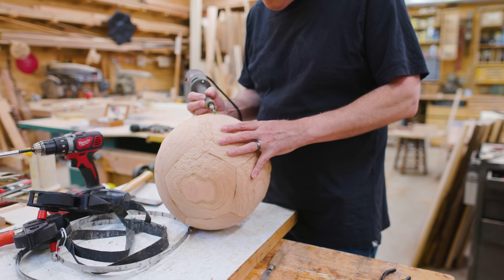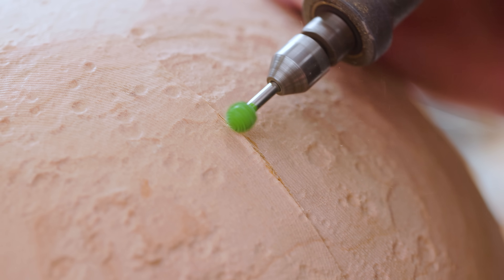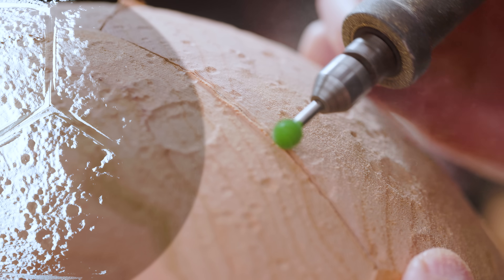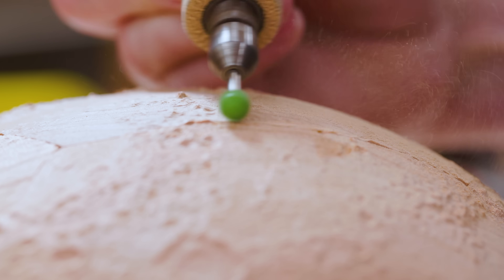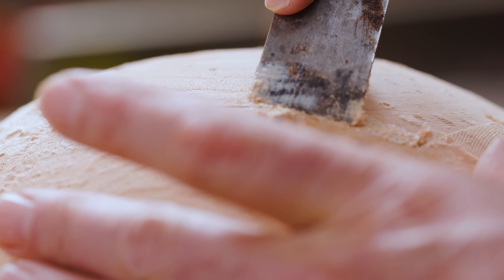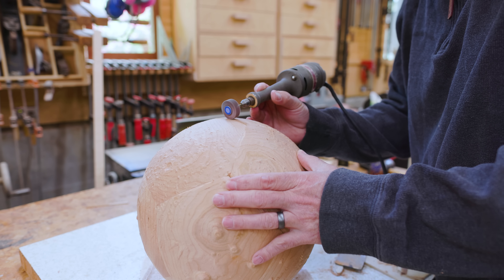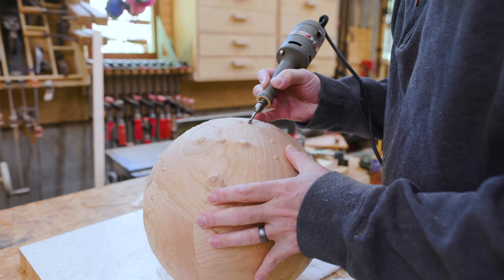I still had a little bit of extra on some of the seams, so I got a little ball grinder to clean them up. It's definitely better than the seams I had on the moon. With the moon I had to reference the edges of the pentagons on the table saw jig, which left me with a lot of extra material and very wide seams. With this one I used the center mortise, which helped significantly with making the seams go away. But I think the problem I'm having now is getting it to glue together well. I ended up putting a little filler in some of the gaps — and it isn't like a smooth sphere where I can sand it, I have to sand around all the little bumps in the terrain. It's much, much better than the moon project, but there's still a ways to go.